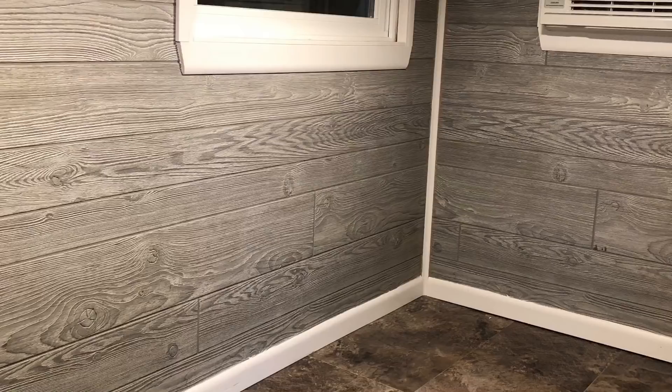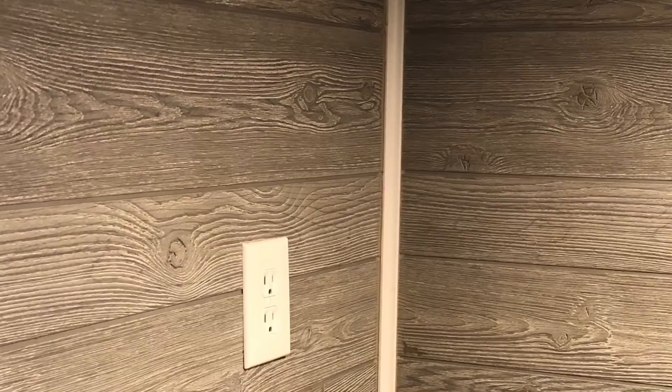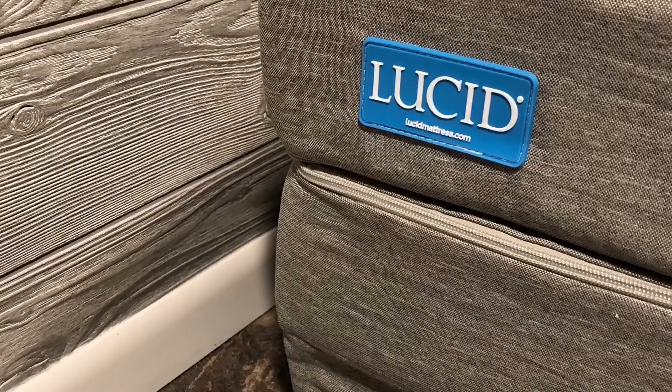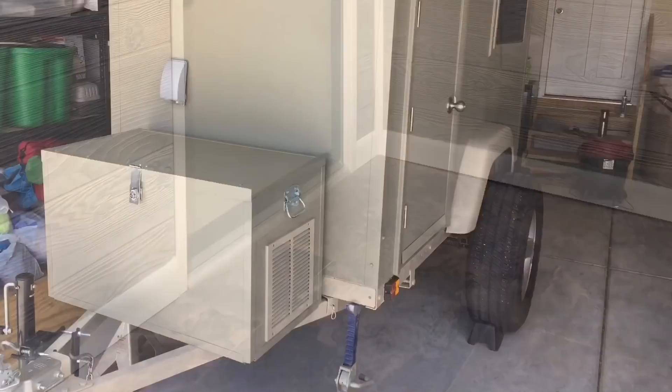The floor was finished with vinyl tile for easy cleanup and everything trimmed out in white. I installed a removable 5000 BTU AC unit, which was inexpensive and easily replaceable should any issues arise. Three power outlets and dimmable LED lighting were installed in the interior, and I purchased a memory foam mattress that doubled as a chair. The door was made out of three Gorilla-glued layers of plywood, trimmed airtight with weather stripping, and finished with a locking exterior door handle.